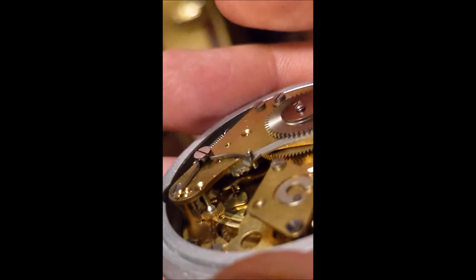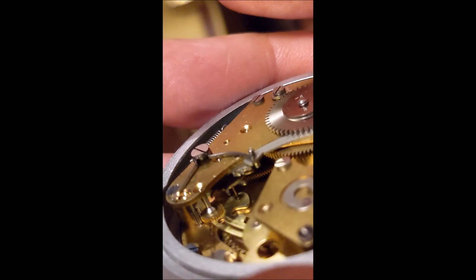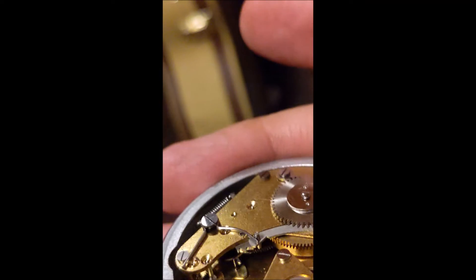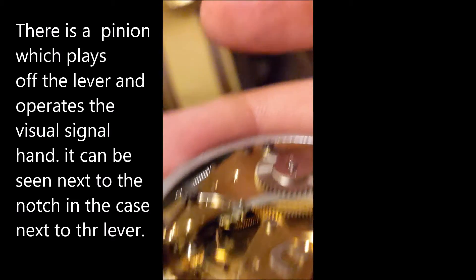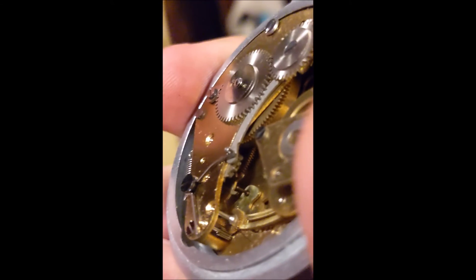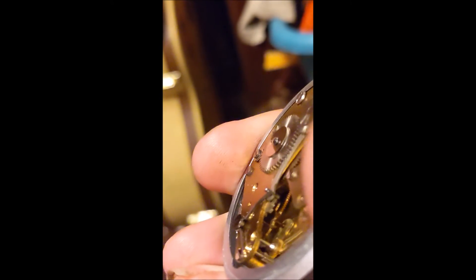If you look down in there, you'll kind of see one of the wheels. Because there is no indicator, the wheels can be pretty much wherever they need to be. That's one pivot right there past my finger — I kind of think that's the only wheel beside the escape wheel. There's its nasty little escape wheel. And when we push, you see that star wheel there — that stops it. Push again, that starts it again. When it stops, it goes all the way over and parks.